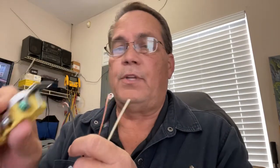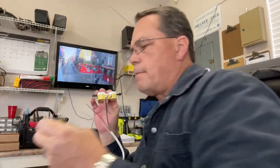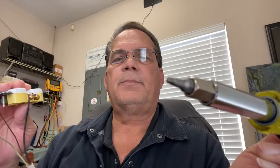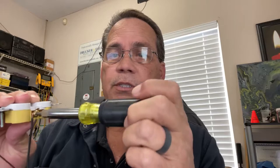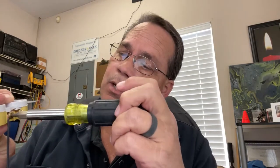That way, you're pulling the wire around the screw as you tighten it up. If you did it the opposite way, you'd be pushing that wire out, and chances are you're not going to get a good connection. Something else you want to guarantee: when you strip that wire back, make sure you don't have any insulation under that screw. This is my handy dandy 11-in-1 — it's got a square bit on the tip. That's perfect for the screws on these outlets and switches. You tighten it up clockwise, and since the wires also go clockwise, it's not going to push the wire out — it's going to tighten it up in that screw.